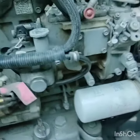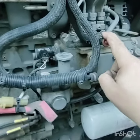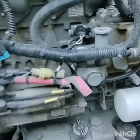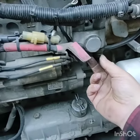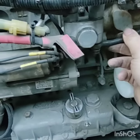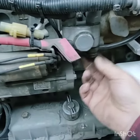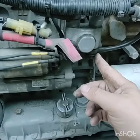Really try to keep up on these things because it's cheaper than a freight claim. If you need to know how to prime a reefer if you run it out of fuel or if you gel up, I have a video on that which you might find helpful. Occasionally between services I like to take this — I call it a banjo bolt — out here. It's got a little screen in there that can plug up with gunk and cause it to run kind of poorly. This is a fuel line here, and I like to clean those out. I run a little less than 3,000-hour intervals on the unit and I'll pull this apart about halfway and clean that little screen out. That's also covered in the video about priming a reefer if you run it out of fuel.